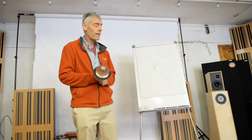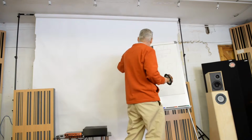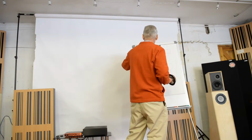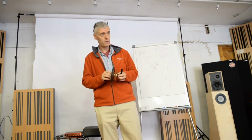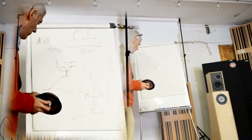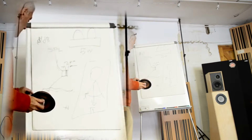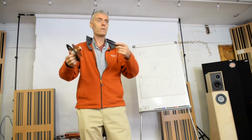And one of the holy grails there is SPL, sound pressure level, which is measured in decibels, dB. The industry measurement is typically this: I'll be about 1 metre away from you. You're the microphone, I'm the speaker. We're in a soundproof chamber. We give that a sweep test, you pick up the sound, and then you get a frequency plot. From that frequency plot, from low frequency to high, you get some measurement in dB, and usually you can then say, yeah, it's 88 dB efficient, it will produce 88 decibels at 1 metre away, and so on and so forth.